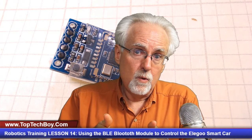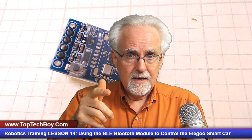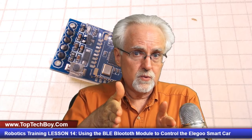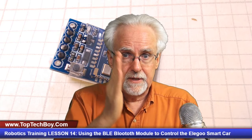As a practicing engineer, your best friend is closed loop control. That is where you don't just say drive straight, but you're constantly monitoring where you're driving and making little mid-course corrections. And really, that's how you drive a real car. It is a closed loop feedback control system. You don't just point the car down the road and then fold your hands and close your eyes. No, you're constantly looking and you say, oh, I'm getting a little too far this way, correct this way. Now I'm getting a little too far that way, and correct the other way. You are the sensor and the actuator of an active closed loop control system that keeps your real car on the highway.